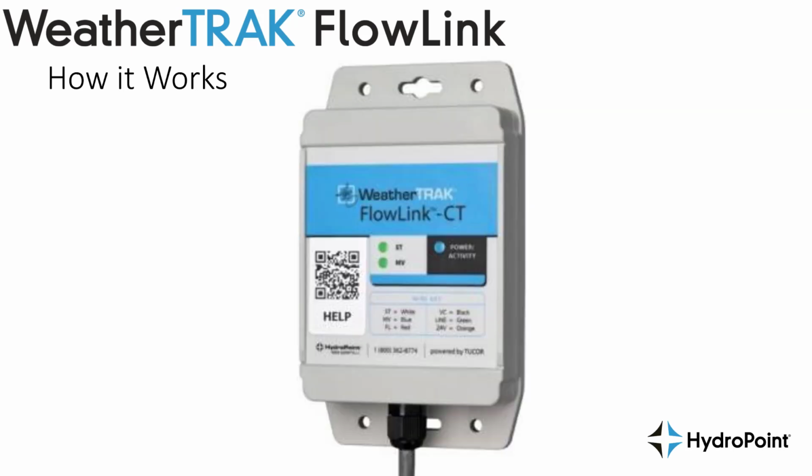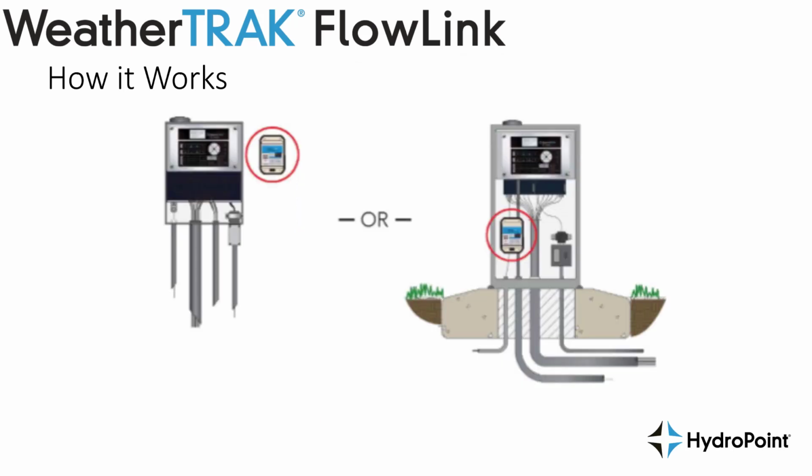And after you've successfully completed the installation of the FXT and the EXT, all that's left on the FlowLink installation is the installation of the CT, or controller transceiver. The first step in installing the CT is to mount the unit close enough to the controller that the wires can extend to the valve wire terminal ports that they need to be connected to.